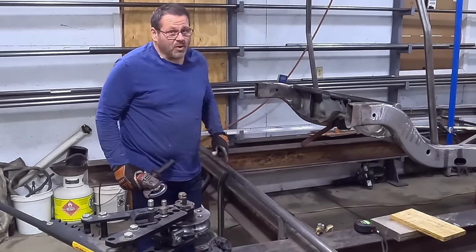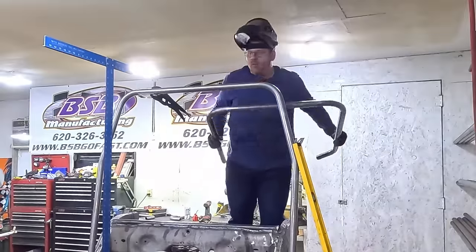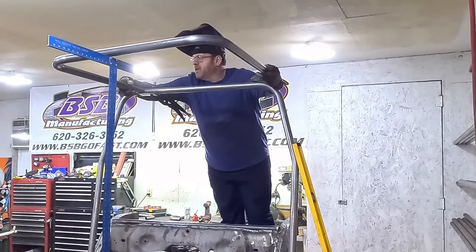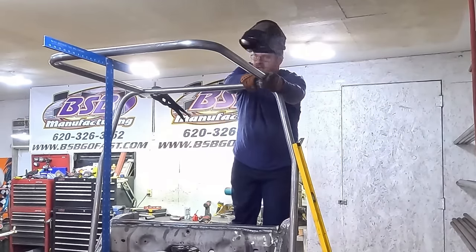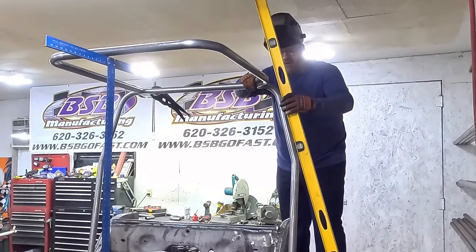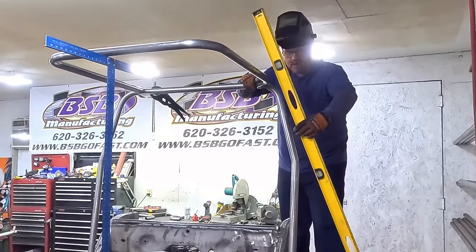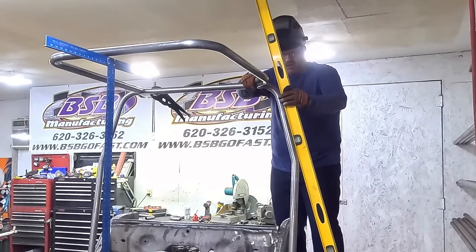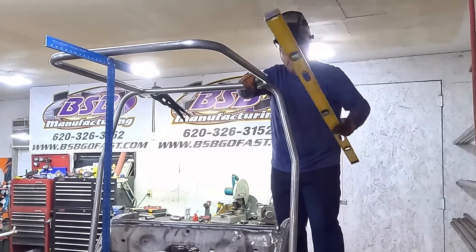Don't take shortcuts — you've got to have those mouths right. This is definitely not a one-man operation right here. What I want is I want this tube to be flush with this 50-degree up leg right here, because that other tube comes up and I want them to line up — I want to be on the same plane. There's probably a better way to do this, but this is going to get us really, really close.